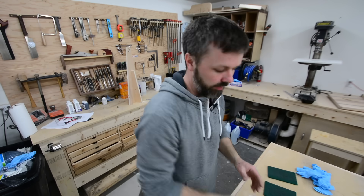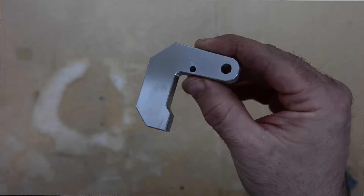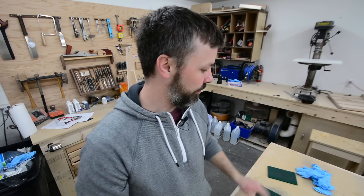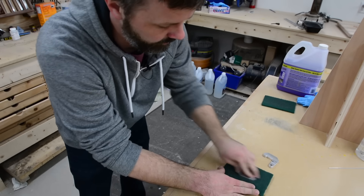Before we get started anodizing, there are two things to consider: the surface finish - how shiny the part is - and how we're going to clean it. Coming right off the mill, I got a pretty nice shiny surface, but you do see mill marks in there. To remove that, I hit it with a green Scotch-Brite pad, which mattes it down a little bit but still gives a fairly shiny surface. The shinier the surface, like if you go over the buffing wheel, the more metallic it will look when anodized. The rougher the texture - say if you put it on the belt sander - the more matte the anodizing will look. The Scotch-Brite pad is kind of a happy medium, and that's what I've been doing.